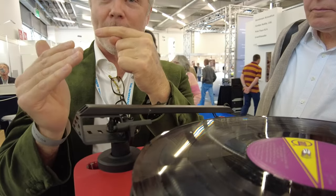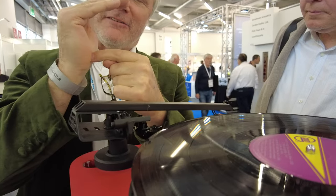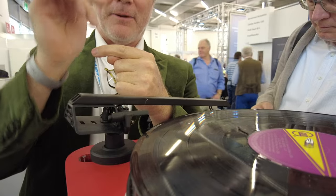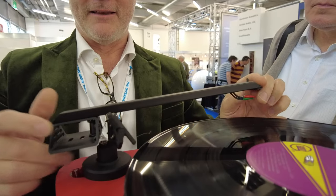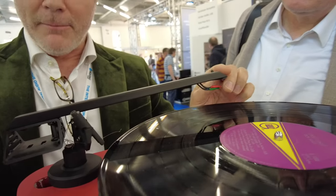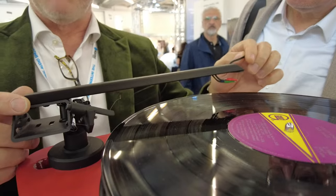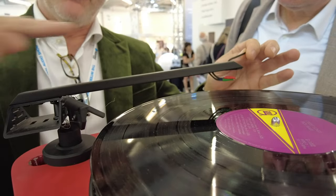The question is, how do you stop the arm dropping off your sideways uni-pivot? Yes. And the answer is that you can suspend the arm from a point exactly above the pivot, so that when the arm does this against the pivot, it's not obstructed by the suspension at all. And you can see this here. You can see that there are two suspenders, somewhat like a well-tempered arm, but they come from a single point, and the single point is directly above the uni-pivot. And so that means that when you move the arm sideways, you have no opposition from the suspension, and the uni-pivot point itself perfectly opposes the pull in this direction.